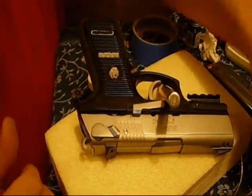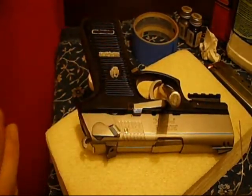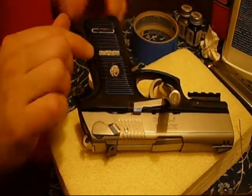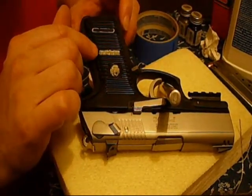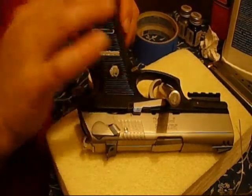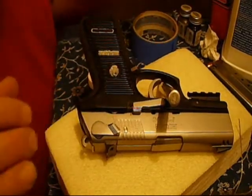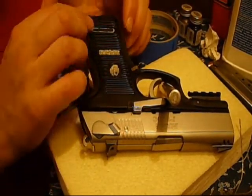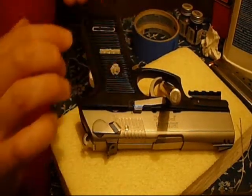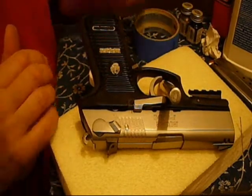You basically let it dry for about 12 hours, then scrape off the excess and use some mineral spirits to take off the rest of the paint. I've already done these three areas here, so I'll show you the step of removing the paint. If there was an accumulation of paint, you can cut right across that — just cut off all the extra paint with an exacto knife.